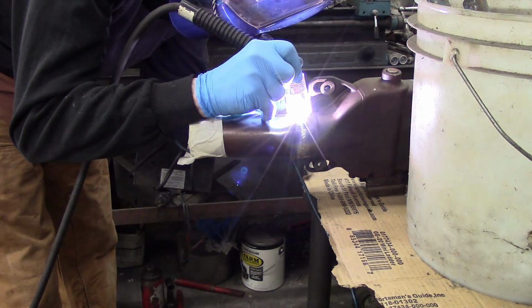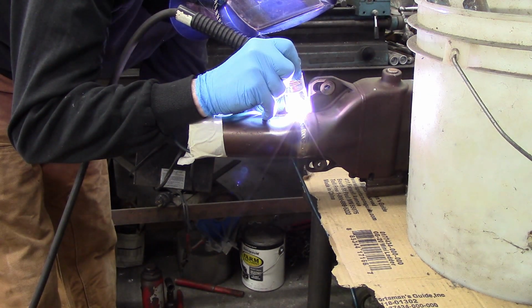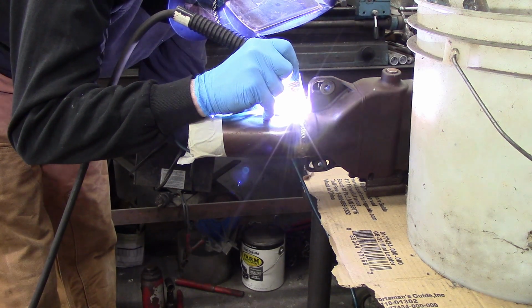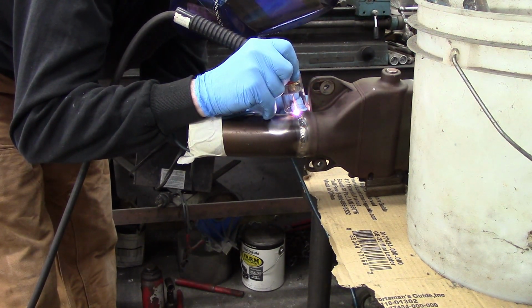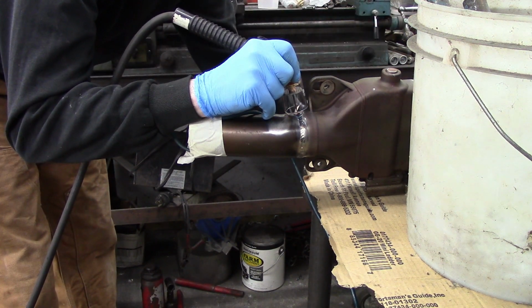Start gas flow prior to your arc so you are positive you have gas flow to your work before the arc starts. And wipe the weld with acetone after every wire brushing to make sure the metal is clean prior to the start of the next weld addition.